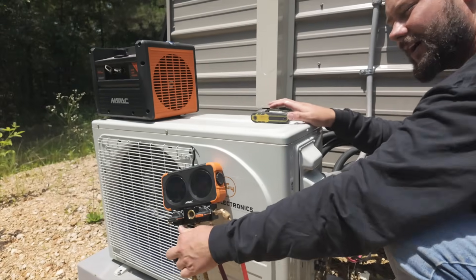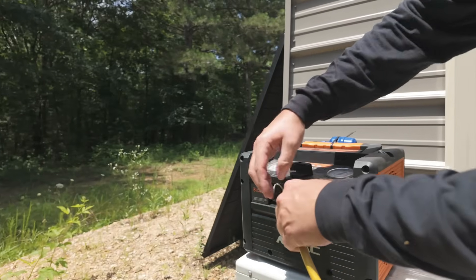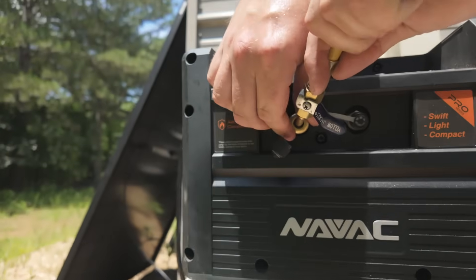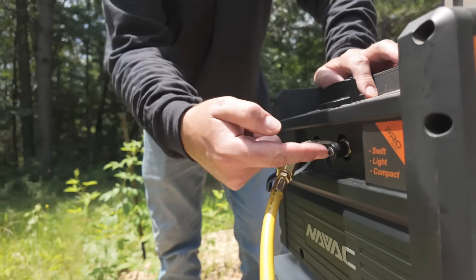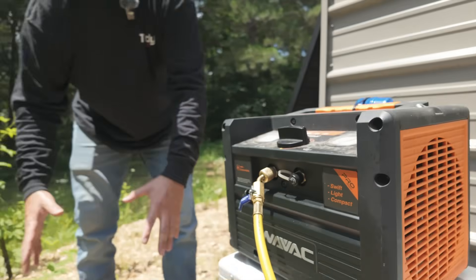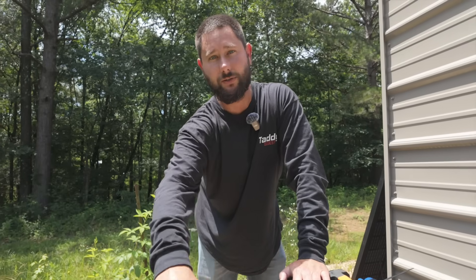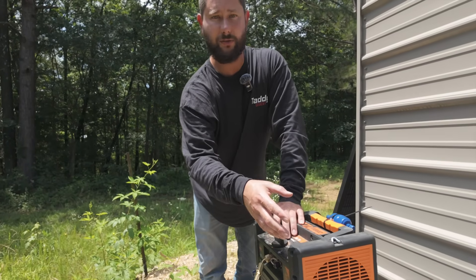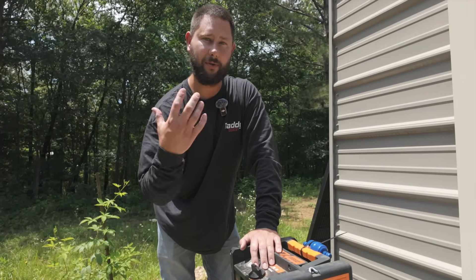If my system is non-operational, I would need to take my yellow hose straight to my recovery machine to the port labeled 'in.' Here's the recovery machine I use — I've got a full video on how to use a recovery machine in the link in the description. Basically I would take another hose from the port labeled 'out' and go to a recovery tank, open the tank, turn on the machine, open my valves, and allow the machine to pull that refrigerant out of the system into the tank. Once the refrigerant gauges say zero, the recovery is complete and I would be able to remove the system.